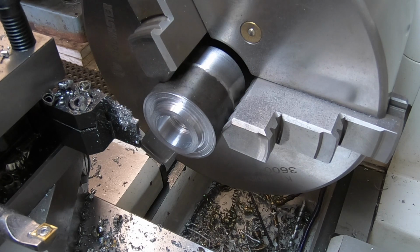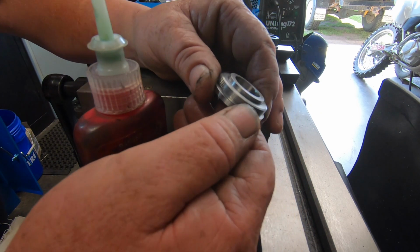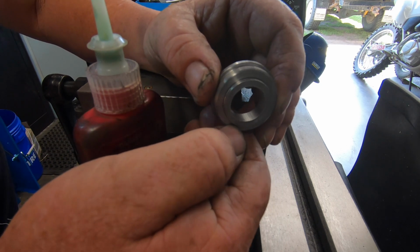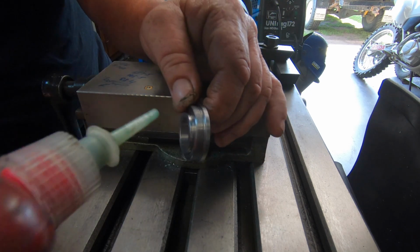Yeah, it's a little bit hot. Too hot. So I've just got the two parts started together. I don't know whether you can pick it up there, you were seeing where I put that little tiny ring in with the threading tool on this outer diameter. It's just to hold a bit of Loctite, which is the plan.